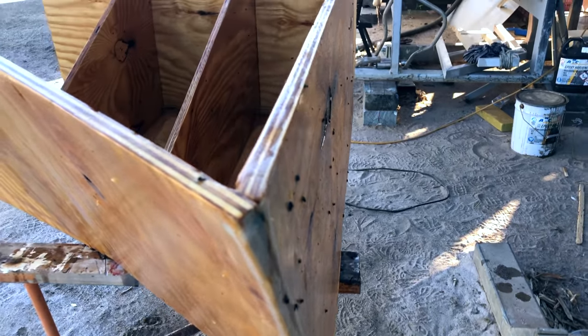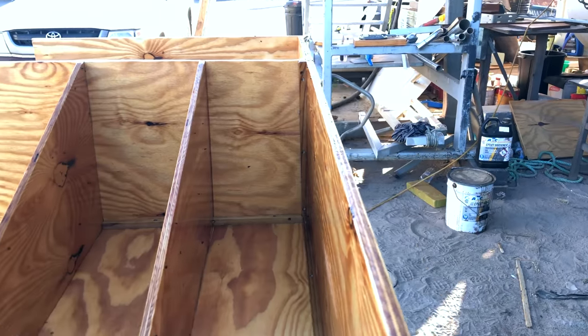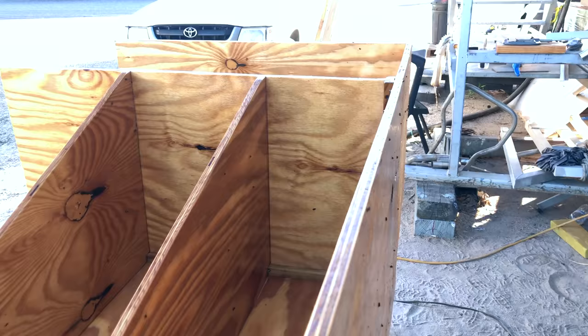I did it. So this morning I'm doing a light coat. I'm using a 240 grit just to kind of rough up the surface ready for painting. But we need to do some filling. So we're going to fill these things here. It's just that it's cheap wood, so sometimes when you cut it, it rips as you go along. Mostly it was okay, but this end wasn't so great.